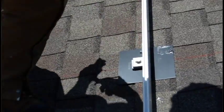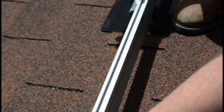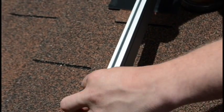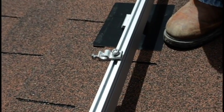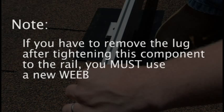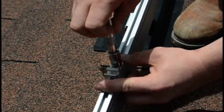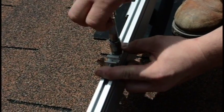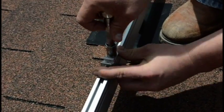Once your rails are attached to the roof, you can begin attaching Weeb lugs to rail sections. First, slide the bolt into the rail bracket as shown here. Next, place the Weeb washer over the bolt and make sure it's flush with the rail. Notice the dimples on this washer — they are designed to contact tightly with the aluminum rail. If you have to remove the lug after tightening this component to the rail, you must use a new Weeb. With the Weeb washer in place, secure the lug over it. Then place the stainless steel washer and secure it with a nut.